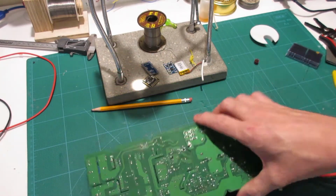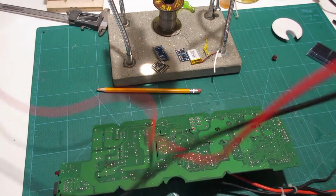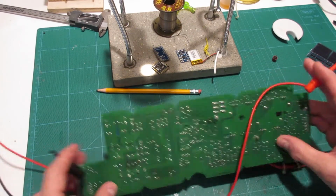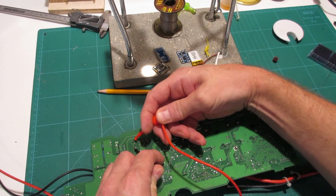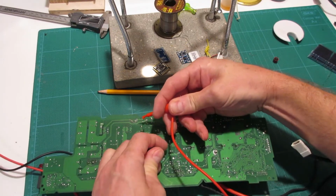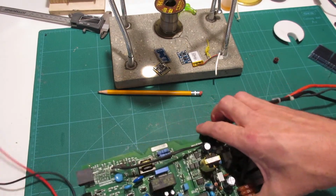So we'll do that. Now I happen to have a little power supply here, but you can do this with like a wall wart or a car battery, anything 12 volts, you know, 5 volts if it's a 5 volt one, whatever. You just have to throw some energy in it. And let's see, where are we here? So let's have a look at this guy here. And you can hear that, it's clicking, right? And then this one here is these 2 contacts here. We'll give it a little energy, and nothing. So this thing is also hooped, which is right by the fuse, coincidentally.